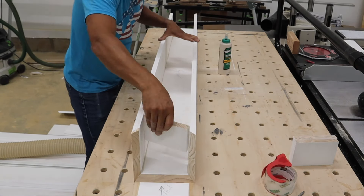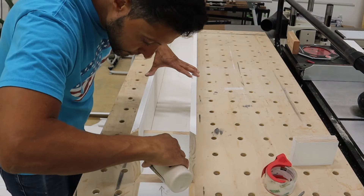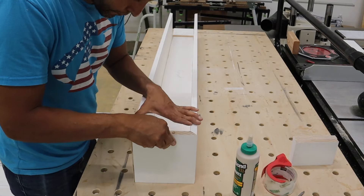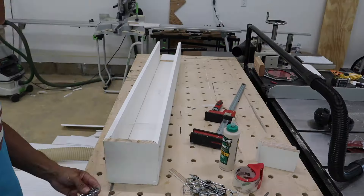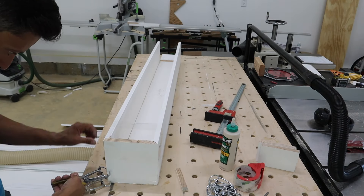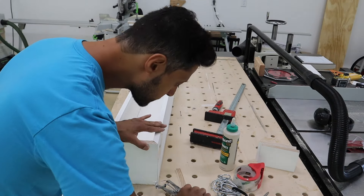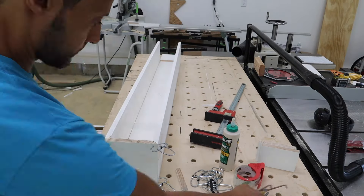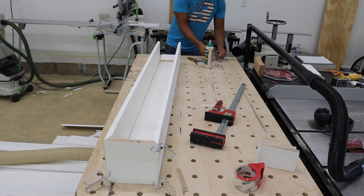You're also going to notice that I'm using spacer blocks, cut to the size of the interior dimensions of the mantle. Not only will this give it more rigid stability and help with the glue-up when clamping, but it also keeps everything square. Make sure you leave room for your mounting cleat — if you cut this right to the edge of the board, you won't be able to mount the mantle on the cleat on the fireplace. Give yourself at least two inches of room because we're going to be attaching this with a 2x4, which is one and a half inches thick.